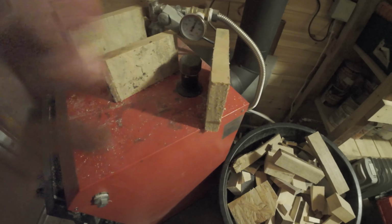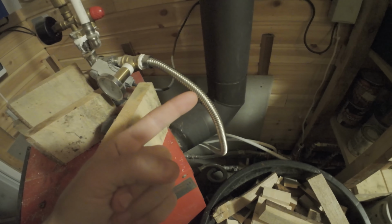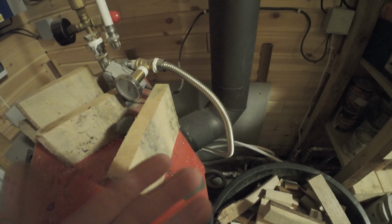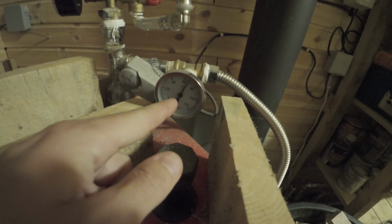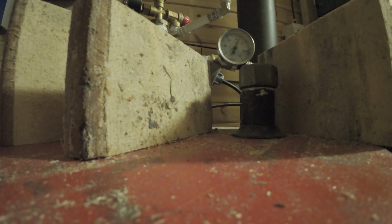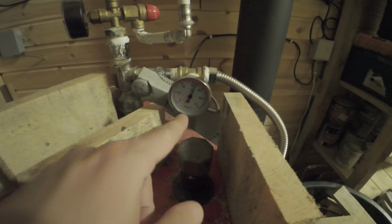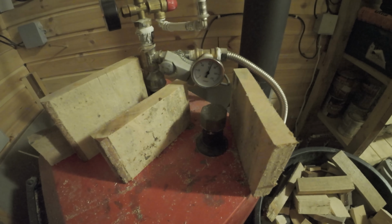There is a limited flow of water that can flow through because you have a weak heat pump, or the pipes are really narrow. So it's one or the other. For example, I'm using the pump at second gear and I'm having 70 degrees. If I turn it to third gear, it will use more electricity, but it will pump the water more freely through. It's not water, it's a special fluid with oiling and stuff like that, so it doesn't rust from